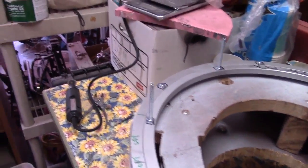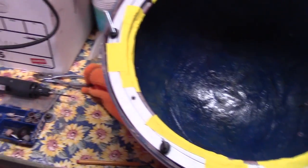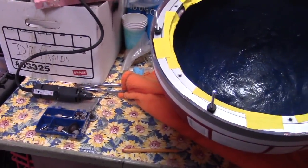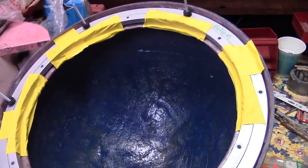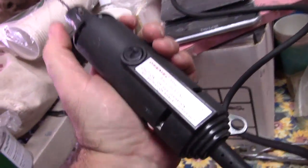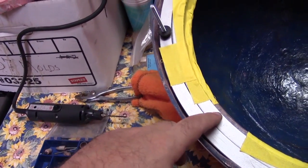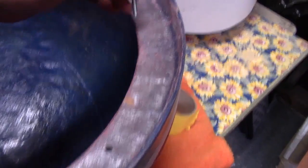What I've got here now is a plenitude of gaffer's tape to hold the bearing in place. I had hoped I could just stick a pen or marker through these holes and drill separately, but it looks like I'm going to have to do the drilling live. One trick I read on the Astromech forum is to drill one hole, put the screw through that, and that will essentially lock everything into place. The bolts I'm using are a little thinner than this drill bit and I don't have any other chucks for this ancient old Dremel Moto-Tool Model 280, so this is the only bit I can use. Using that same bit, it was easy enough to just drill it a little wider than I needed.